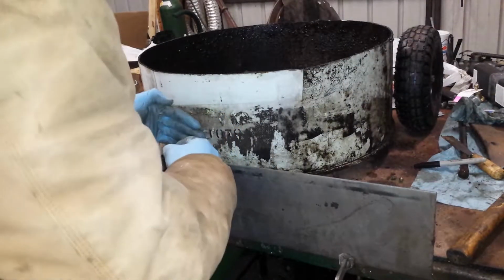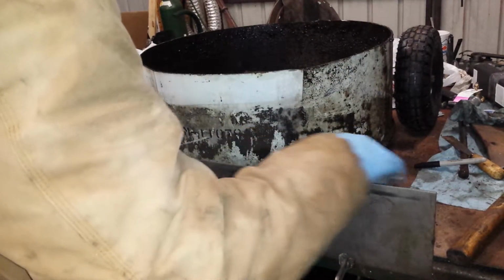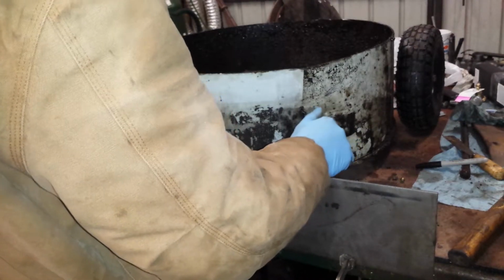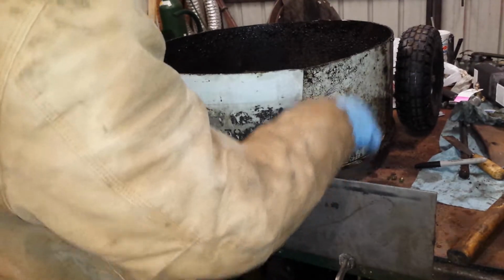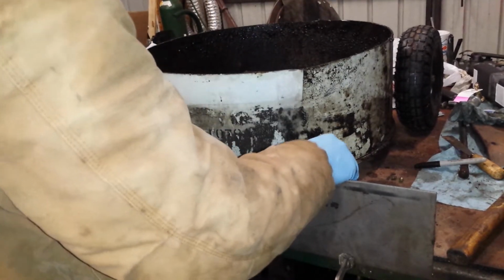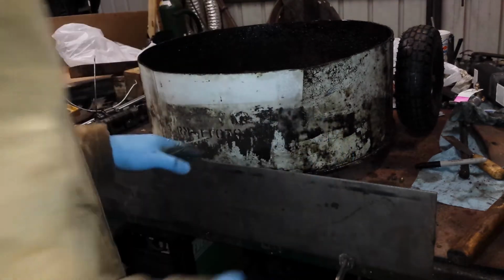So I guess I'm going to do my 2-inch offset here off my plate and measure off the rear axle parallel to my table and do the same up here, and then I'll probably figure out where I want my drain and the coupling piece there on the back, and that way when I turn the welder on, I should be able to weld the axles and that guy back there all at the same time, and then I can figure out how I want to do my handle pivot.